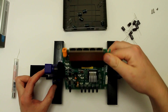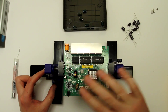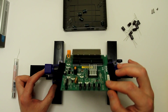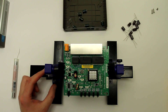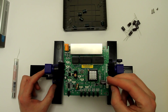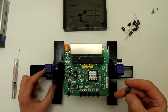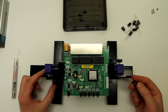I did all eight of them — it was a fairly boring procedure — and I do have all eight capacitors unsoldered. The vias are all cleaned up so I'm ready to put new capacitors in and see if it works or not. These are United Chemical capacitors, rated 105 degrees, so they should last longer and they are rated I think 7,000 hours or something like that.